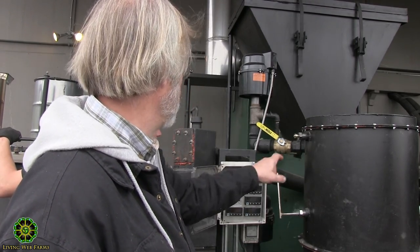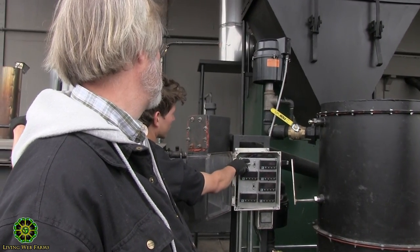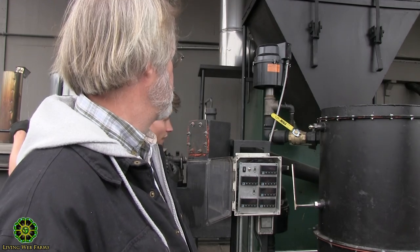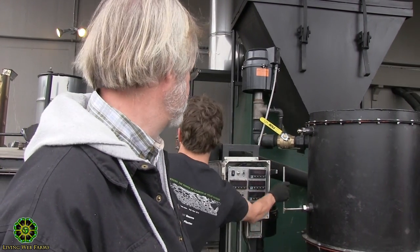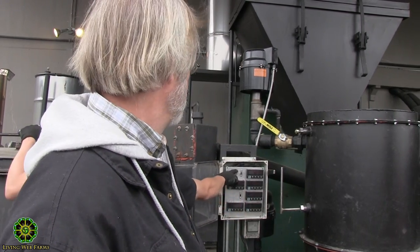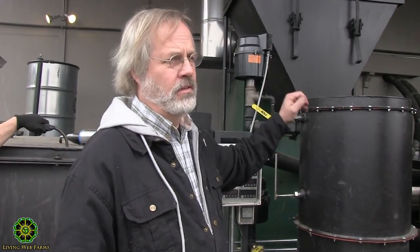And then coming off of the back channel is what? Right now the back channel is 246. So we just started heating that thing up. It's going in at 1100 degrees. This is underneath that retort. It's coming out, it's still only 300 or 230 right now. When it gets running more efficiently, that one will rise up. So the back channel will be closer to the front channel.